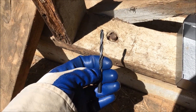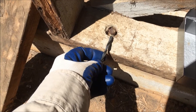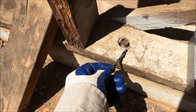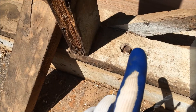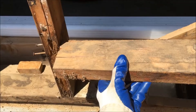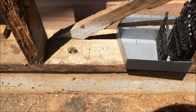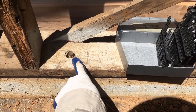So what we're going to do is use this drill bit to drill around this foundation bolt, so this wood — the sill plate — has some relief to move that way. After we get some relief around this bolt, we're going to use a sledgehammer and hammer the sill plate that way, so we can get this sill plate as flush as we can. This piece of wood was nailed in right there — we had to remove that so we can get access and drill directly into that sill plate around that foundation bolt.